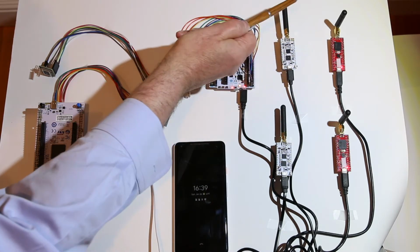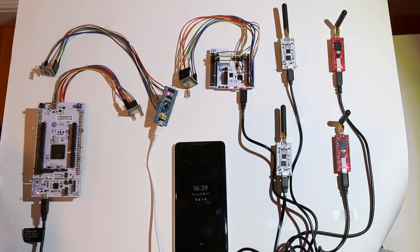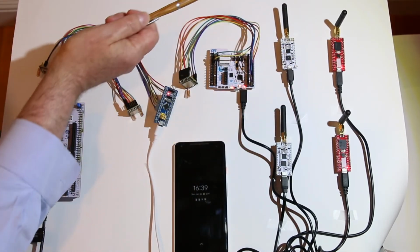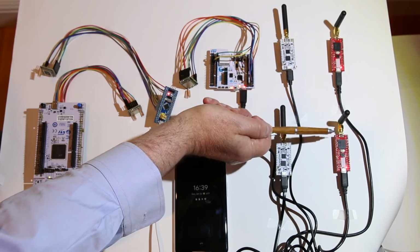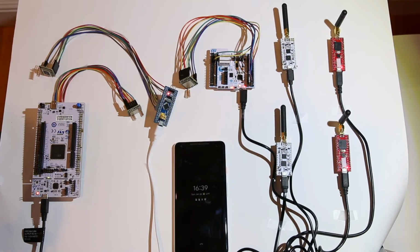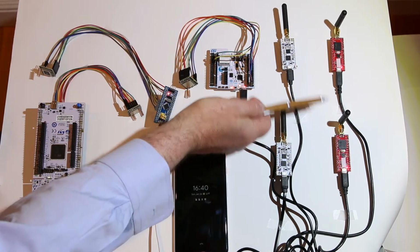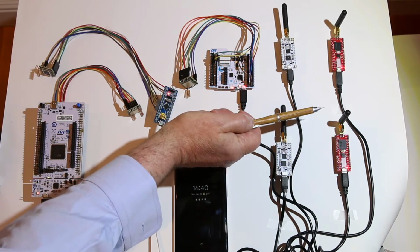And in fact, inside there is an STM32L073 and the Semtech SX1276 module. So it's one of these modules, basically. Well, it looks like a single chip. So I got these and got Ada working on that. And this is an older style ARM chip. It's an ARM V6, so it's a Cortex M0 Plus. And so that makes the code density not great, but it worked out in the end, and we got LoRa working on that, a proof of concept.